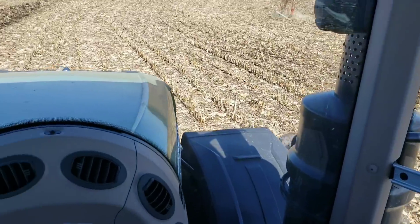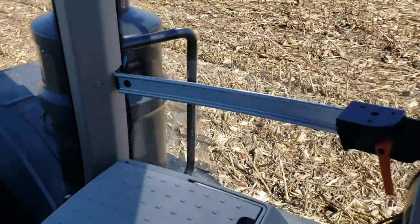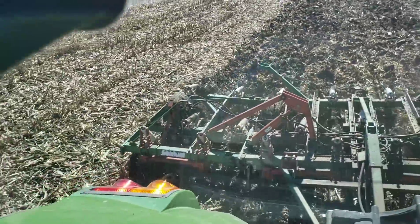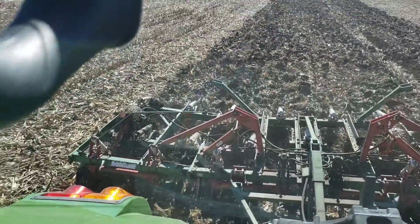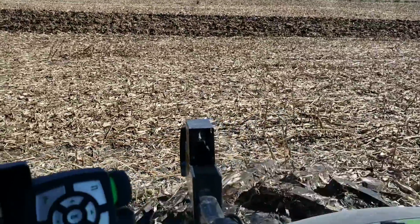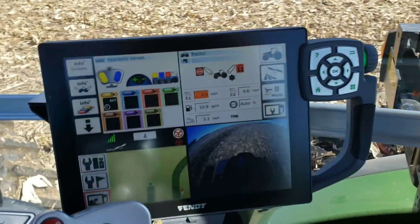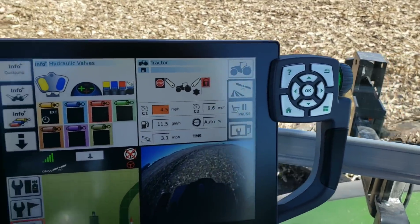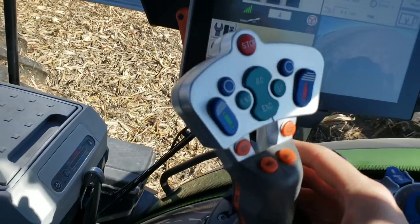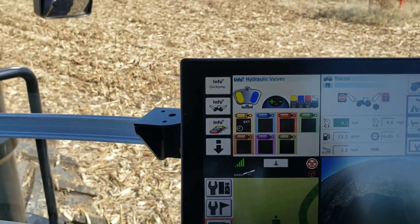Enter beast mode. I love this cab. This machine just plays with this chisel. Working great. A little muddy in some places but still working good. I have it preset at four and a half just because of the chisel — the tractor would easily pull it quicker — but all I do is trigger in and bump sideways, goes green light, boom, I'm at my preset speed.